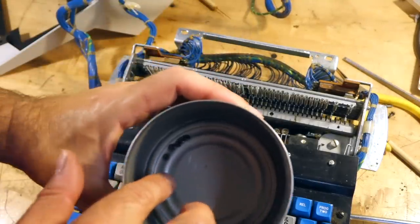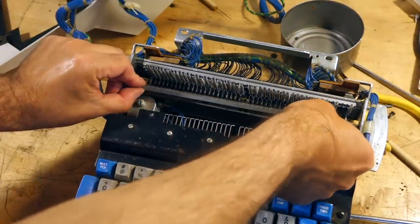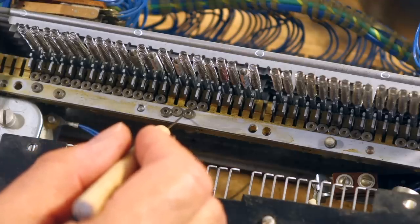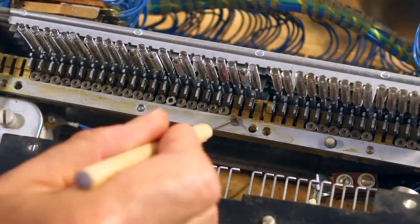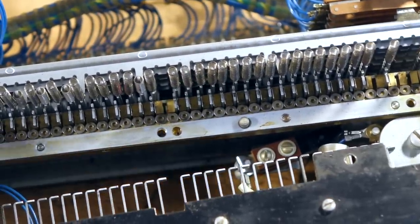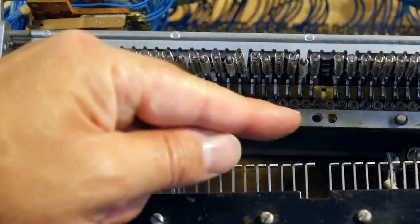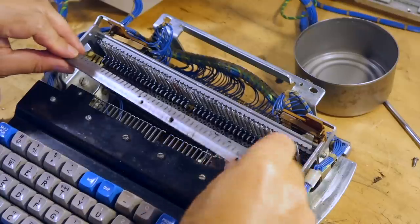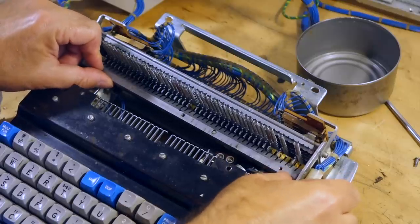These little disks were starting to fall out — these little washers. They were stuck in between this piece and the piece next to it. So these little guys which are stuck here are not supposed to be here, they're supposed to be in there. So I'm going to put them back in. I got all my little washers in a row, and they are made so that just one of those things can move at a time. So if I move that one forward, it'll push all the rows of washers and prevent any other key from being drawn down at the same time. I think we have a major crisis averted.